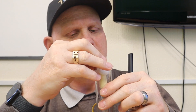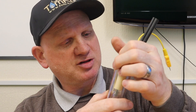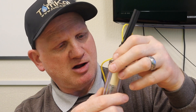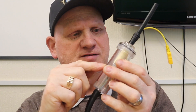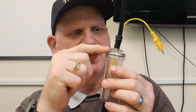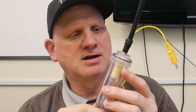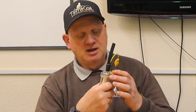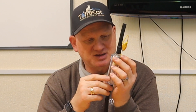Fitting the filter the correct way round is a bit more fiddly, but it makes it all watertight and stops moisture from the bowl getting above the PTFE filter and into your analyzer, corroding the pump and breaking it. If you're allowing your bowl to get water in it, you're doing it wrong — this is just a safety device in case something seriously goes wrong.